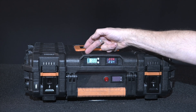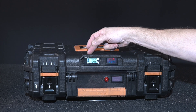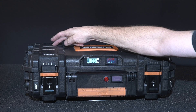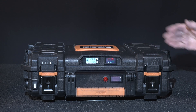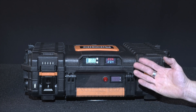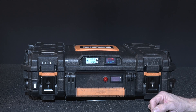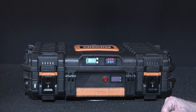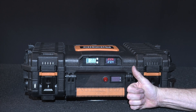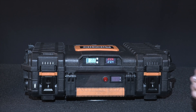On the front of the box in the lid is an overall voltage and temperature meter. There's a thermistor on the inverter and a thermistor on the charge controller, which lets me monitor temperatures when the box is closed. If something gets a little warm, I'll see it and be able to shut it down or open the lid and let some air in. So that's it! If you made it this far, give me a thumbs up — I really appreciate it. Consider subscribing because I'm always doing stuff like this. Thanks for watching, and we'll see you in the next one.